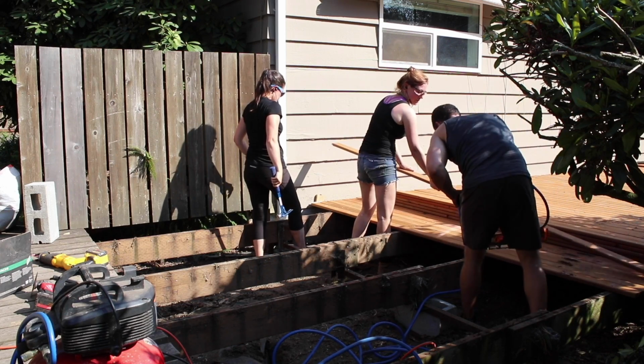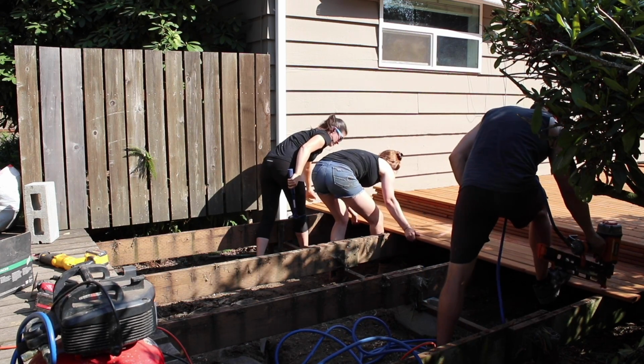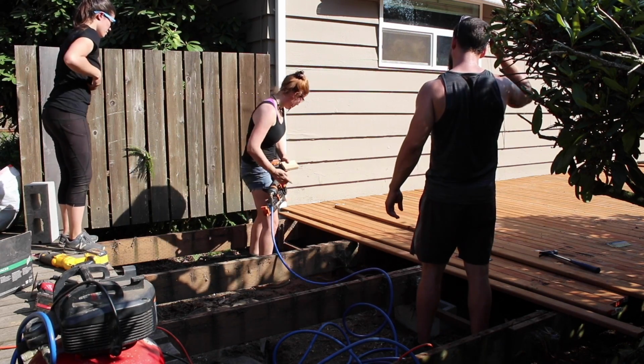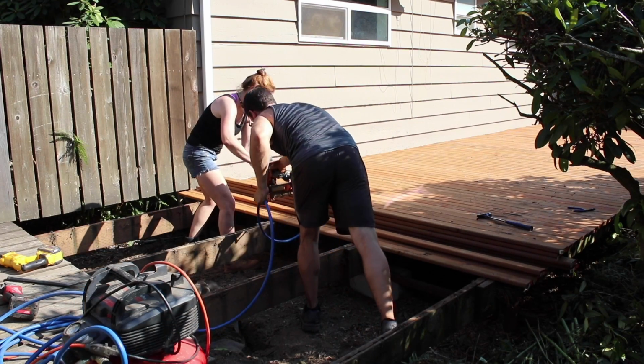The end of the board that's opposite of the house can be cut straight after all of the boards are laid down. However, getting a straight line cut up next to the house wouldn't be that easy. So this line is where we made sure they lined up straight and nice by placing the same spacer in between the siding and the board before nailing it down.